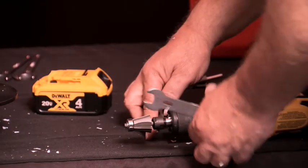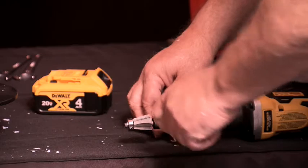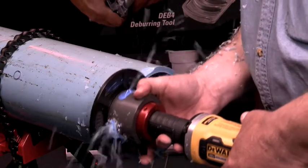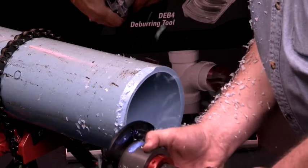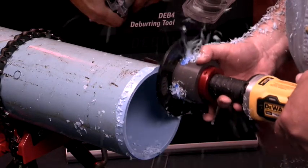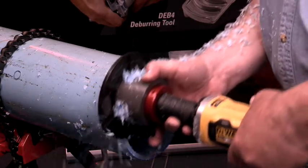The R-bit 2 one-inch bit removes a large amount of material. Therefore, it is strongly recommended when cutting a three-quarter inch to one-inch depth bevel to make two passes around the pipe, removing half of the material with each pass.